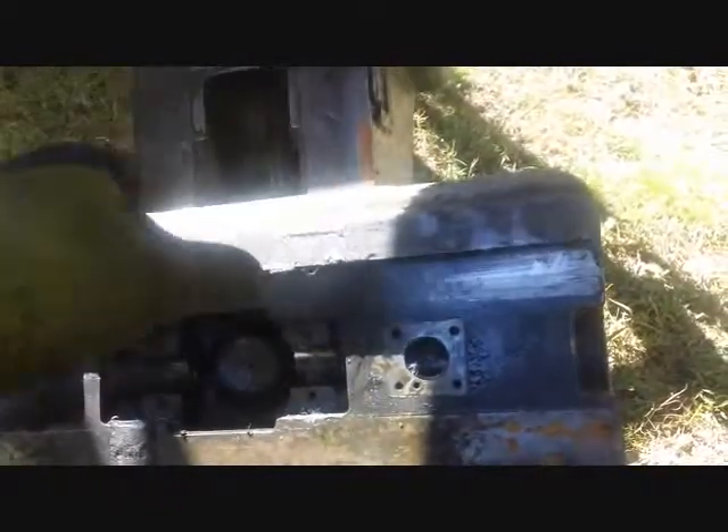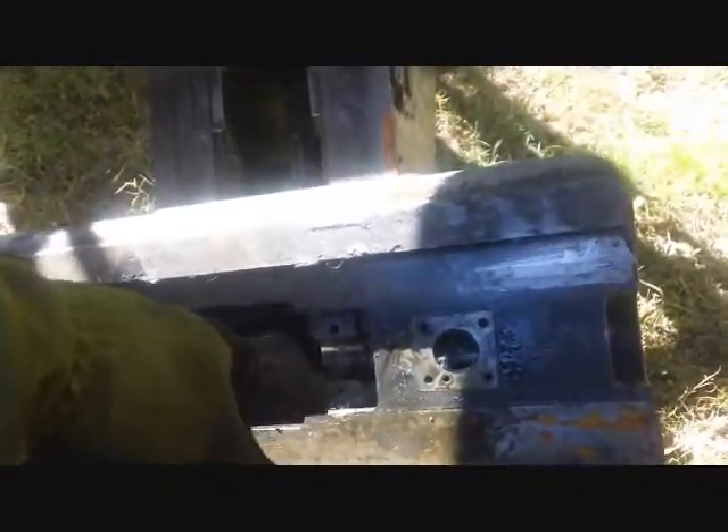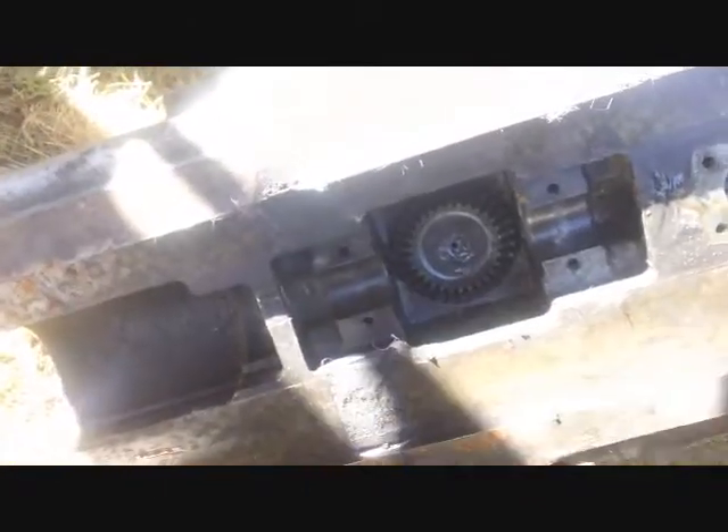That shaft does not want to come out just by unscrewing that spanner nut, so it seems like I'm back to the problem of needing to get the saddle off in order to get any of those other parts out. It looks like there's a bracket that holds that shaft with screws probably screwed in under the saddle. Once I get the saddle off I think I'll be able to expose some screws that will allow me to unscrew that bracket. This gear has to come out first I'm pretty sure, and I just found a big clue — there was a screw on the back side that I didn't notice before.